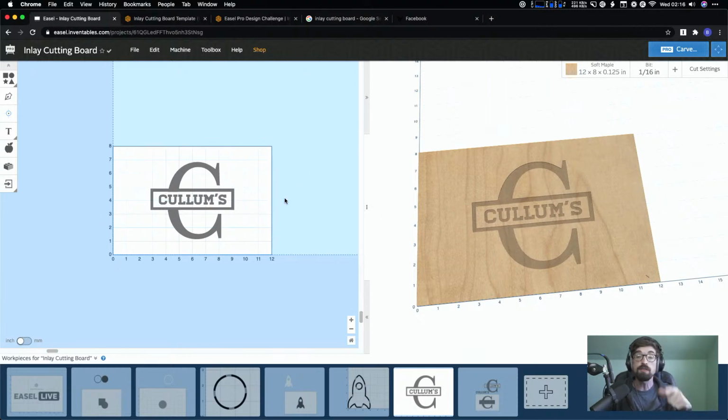This is definitely something we can cover, because when I was initially learning CNC stuff, working at Inventables, the position of your machine in relation to your material can be confusing, because you have different zero points. When you zero your machine when you first turn it on, and then you can have your zero point of your work material, a bunch of different points.